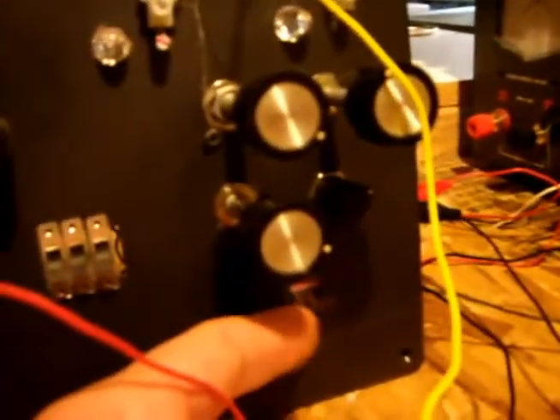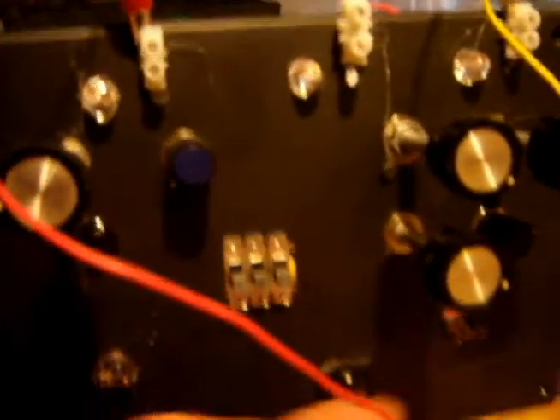It consists of three 555 timers. These jumpers are for changing the capacitors for the timing sequence. The potentiometers are used to adjust the pulse frequency and duration. This strategy provides me with the opportunity to explore how the coils perform given these two specific traits, unlike all of the static circuits that I have seen out there. I believe that frequency and duration combinations need to be explored, as they are variable in nature. One timer, that I will call timer 1, is configured to be astable with full-range configurable duty cycle.